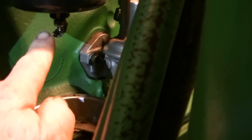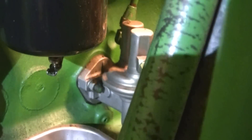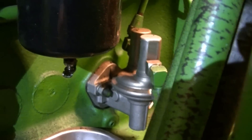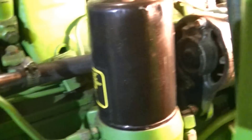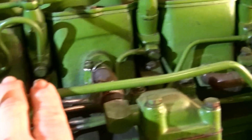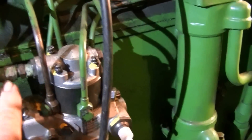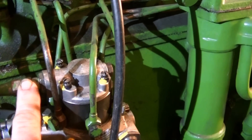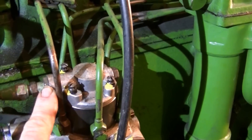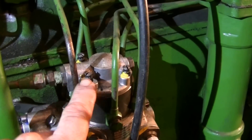At the bottom of the primary filter you can see a little valve — that would be for checking occasionally in case you've gotten water in with the fuel; it'll rest in there and you can let it out the bottom. After that, the fuel follows this line and goes into what is possibly a check valve, and there is certainly a big sintered bronze fuel filter in there to keep any dirt out of the system from getting into the pump head.